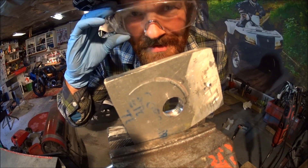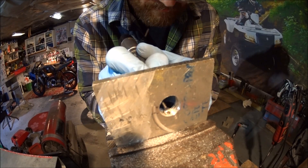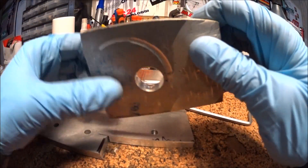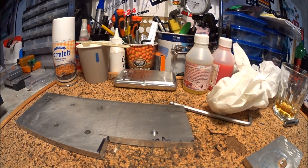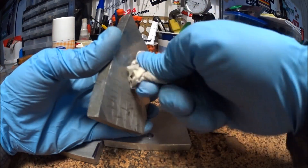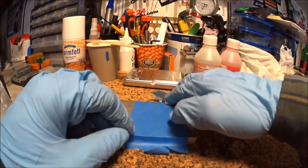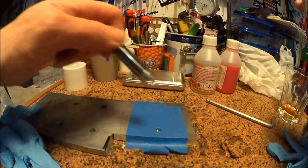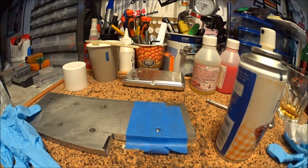Notice the glasses, Fritz? The dimples are in there. Then it's just a matter of cleaning up everything with some acetone and applying some painters tape. I'll use the Norwegian equivalent to PAM — you know that baking fat, spray fat — I'll just rub that in there, and that's my release agent.